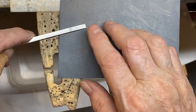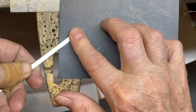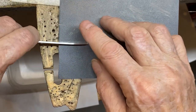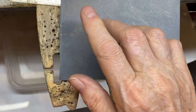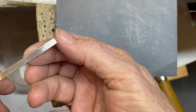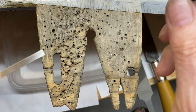First thing when you're done with the miter cutting vise is remove those burrs — both sides, top and bottom, and both edges. Take it flat on the sandpaper to keep nice square edges. No burrs — bad burrs, bad burrs.